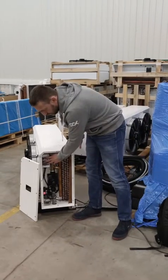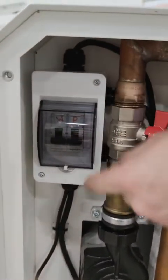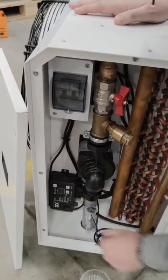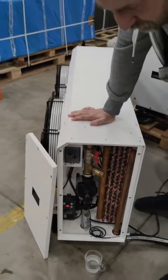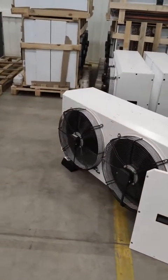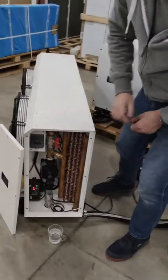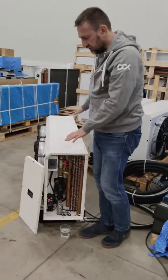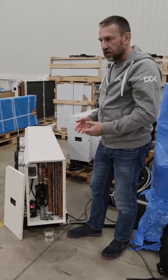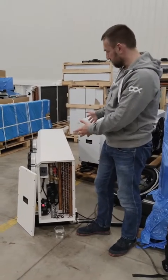Two fan modes: one is full fan mode — breaker W up — and that's the full speed mode; at that point the fan controller should be shut down. The full speed fan capacity is aimed to cool the system at summertime — 35 degrees Celsius ambient (95 Fahrenheit) — and it should reject 40 kW of heat from your miners. This is a pretty powerful device for such compact dimensions.